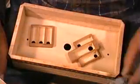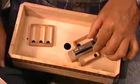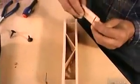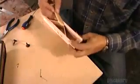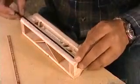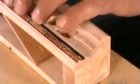Now he constructs the left-hand keyboard. He sets the reeds into the left wind chest using a hot iron and beeswax, just like before. The valves in this keyboard are made of pine, a more flexible wood, making them easier to install in this enclosed space. On the outside, a decorative wood inlay, a strip of ebony and some rosewood detailing. The left-hand keyboard has 2 buttons corresponding to 3 reeds each. It produces 2 bass notes and 2 chords.